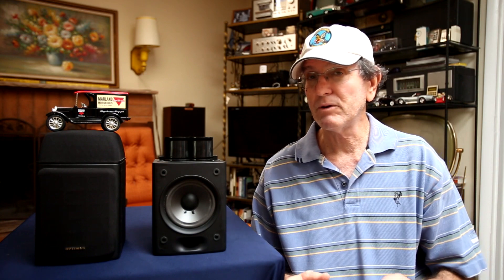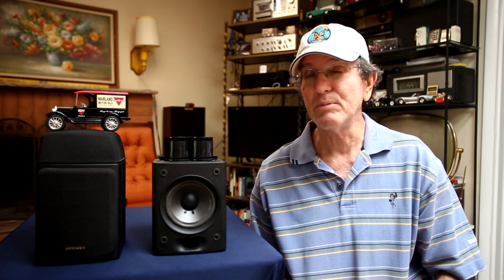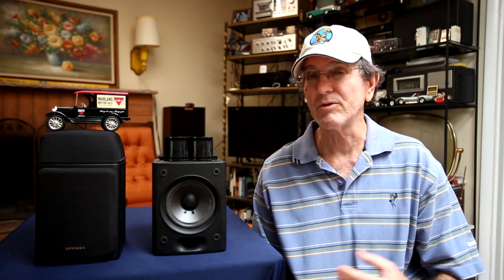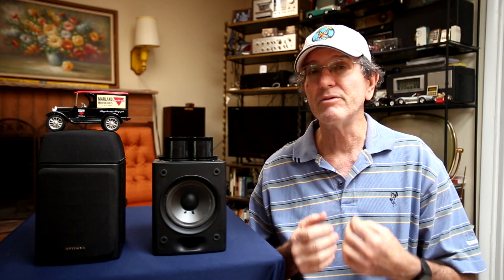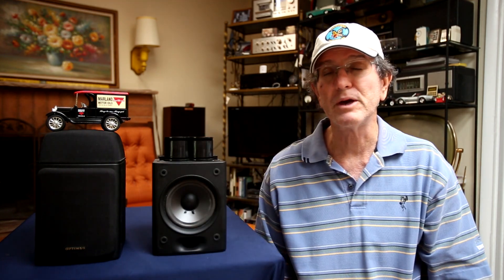So their 25 kHz specification — I'm not sure if that was accurate when they were brand new — but these are definitely not flat anywhere near 25 kHz. They start rolling off at about 10 kHz as the data shows. Maybe that's due to the capacitors being a little weak. As far as I know, these are the original speakers aside from Ian's refoaming of the woofers. Both the front and top covers were removed for the listening test.